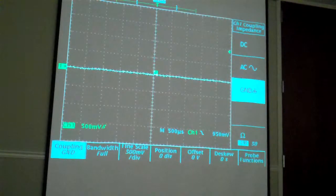Imagine you were looking at the output of an operational amplifier circuit that had a really complicated waveform, a lot of really fast things going on, sort of like Dale's design in the Polymax robot, which I had copied with his help. And there are some DC levels in there. You've got to be watching what's going on with your input coupling. It really doesn't necessarily have anything to do with testing the power line.